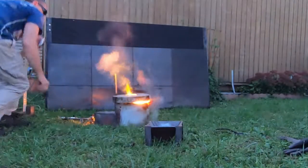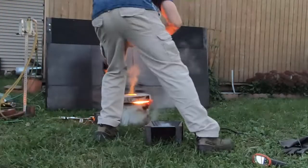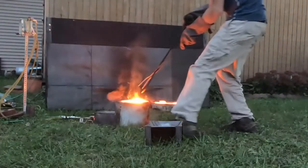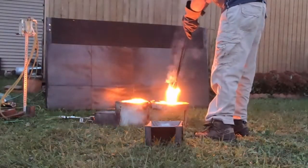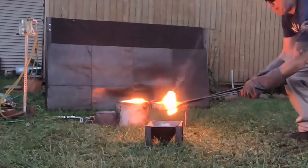I'm shutting it down here now. I can see that the crucible itself is melted. We're losing crucible fast — we lost about 25% of the height of the crucible. The heat coming off of this thing is so intense that you just can't really be by it. We see a large chunk of debris in the top of the crucible here, which is actually a piece of the foundry furnace ceiling.